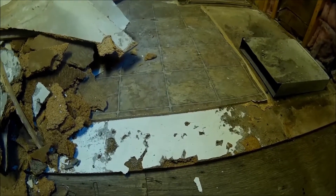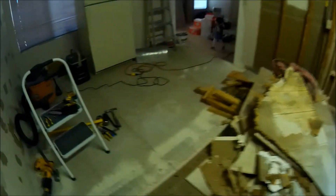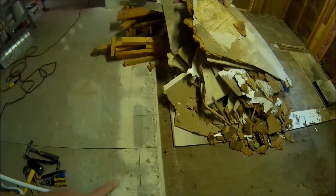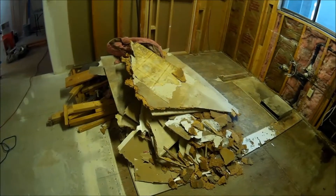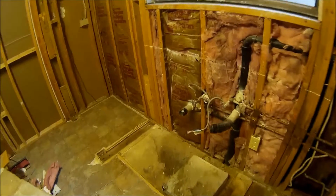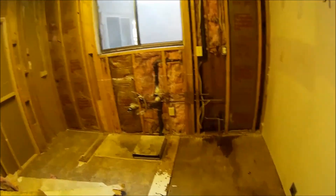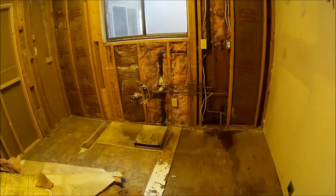Disgustingly, ridiculously stupid. So now I have to rip out the entire floor, at least in the kitchen area — obviously it's still okay in the dining area. Basically from this line over, all that's got to come out. I was hoping to be done with demolitions today, but I'm not. I need the plumber in here — I've got the water shut off right now, but this thing's still dripping. I'll have to admit fault: I nicked that pipe, so it's dripping. Everything upstairs still has water in it, so I need to find a lower point downstairs and drain it so it doesn't soak everything up.